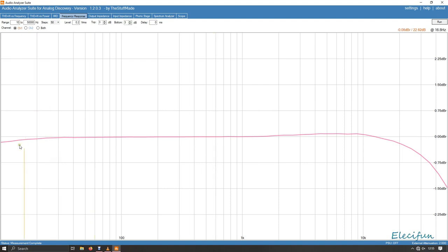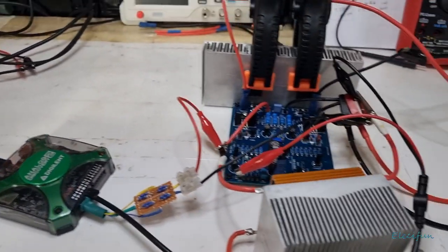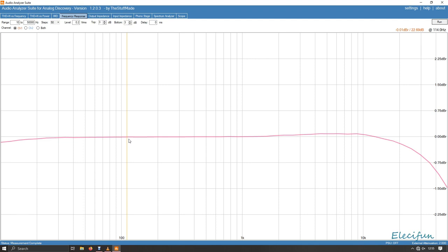I've decided to connect up this Vigilant again using the differential input, just to see what this is like. The nice thing about using this audio analyzer suite software is we can do THD and noise versus frequency across the entire frequency range — I haven't figured out how to do that yet in ARTA. So let's look at the frequency response here — this is 20kHz.